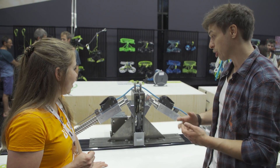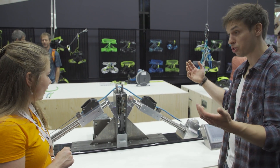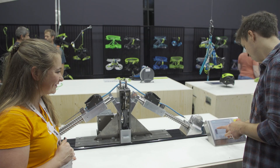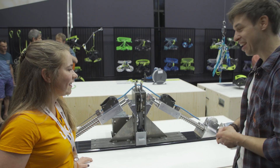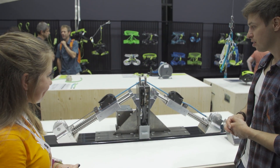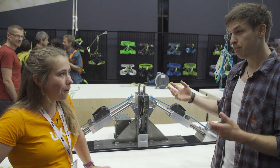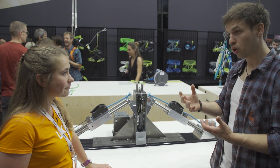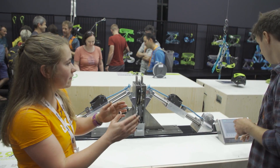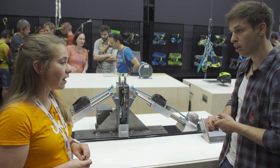So the distance is measured - that's the result. Let's do it. We set it to 75 kilos - that's a normal-sized person, maybe the average reader. Here we go. Now it gets tension, and there we go. This looks very quick but you have to remember this is a lab test, like a standard fall test - something you want to test for. The most important thing is reproducibility: the distance for any rope will always be comparable. We now have 11.9 centimeters. That's the value of this rope at 75 kilos.